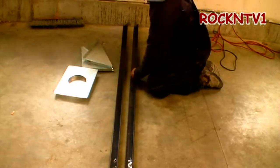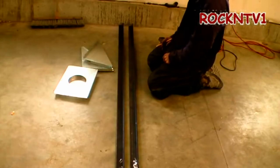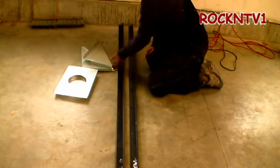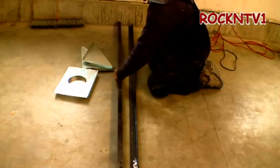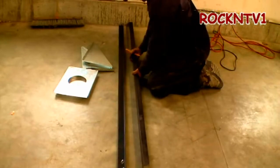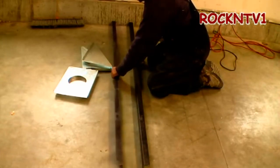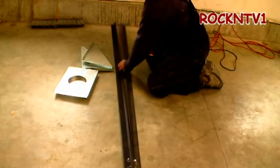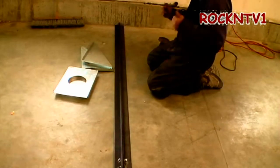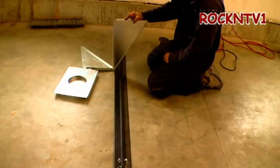That being said, we've already measured my stuff. I have just enough out of that one bed frame to make my four 29-inch pieces, which I'll be able to get some angles on and then weld up nice. When you make these brackets, you've got to remember that they're left-handed and right-handed. I need to make four 29s, leaving me two 17 to 18-inch parts for my upright verticals that will get bolted to the wall. Then the 29s will get angles put on them, and we will make the hypotenuse of the triangle, and that will be the bracing for this.